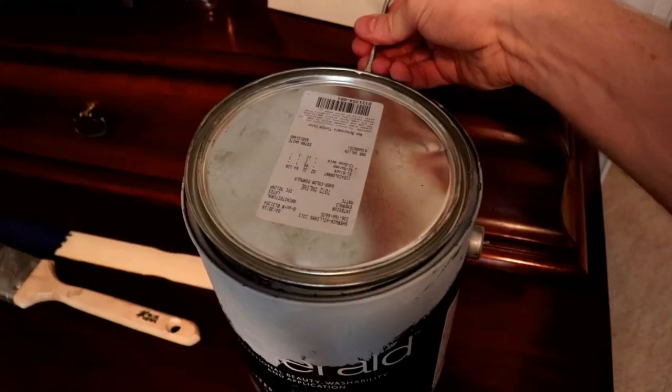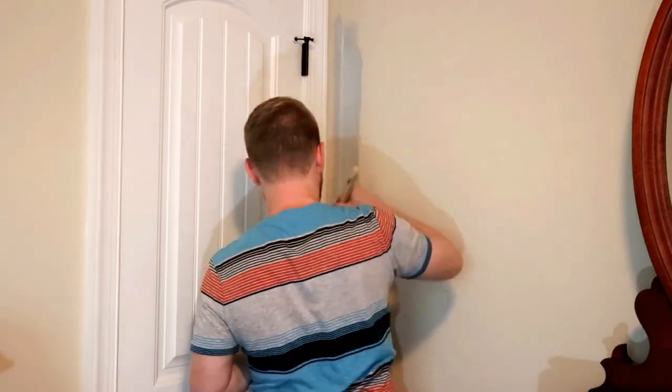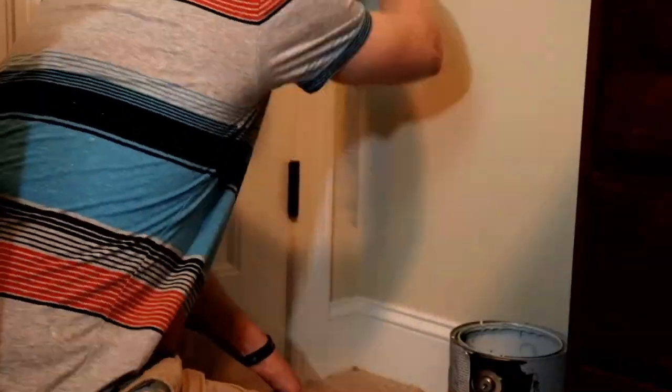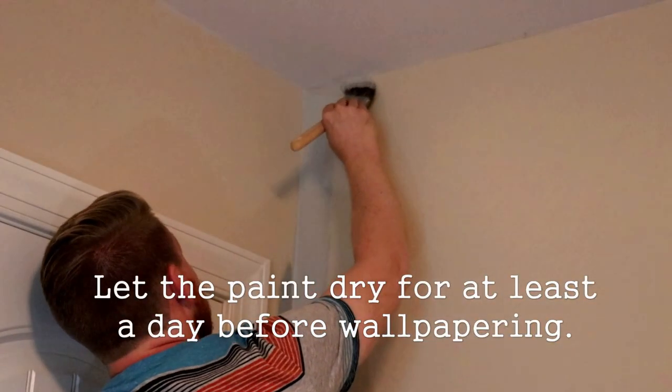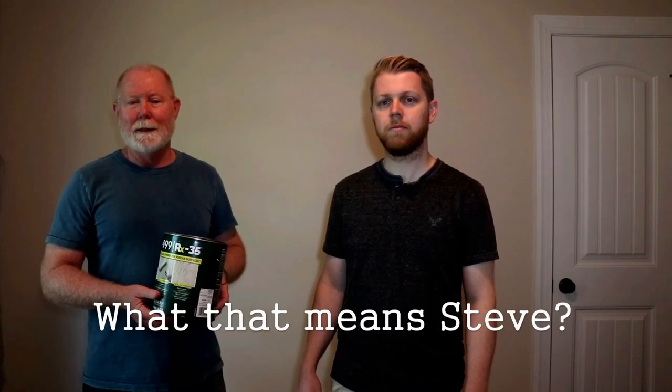The rest of the room is going to be a different color than this. Before we put the wallpaper on the wall, we're going to use a sizing or a primer. The reason you prime a wall is you need to make the wallpaper stick to the surface and seal it so that when it's time to remove the wallpaper, you don't tear the wall up. We'll probably be using two coats of acrylic latex primer. This is a low VOC — volatile organic compound — which means it's less hazardous to use.